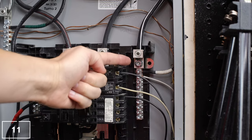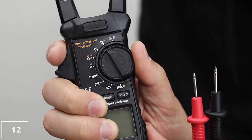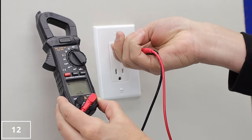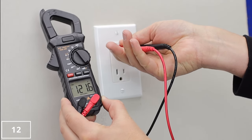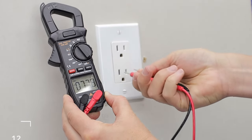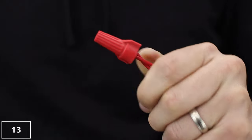Do not ground your neutral wires in a subpanel. Tool alert! This is a multimeter — definitely pick one up. We are going to be checking the AC voltage, that's the little squiggly line. It is a good habit to use one hand so you don't cross the streams.